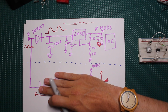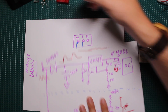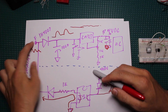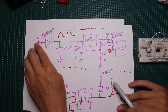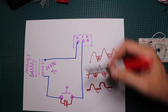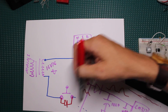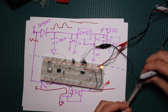The circuit has two parts: a power supply section on top and a negative-going detector circuit on the bottom. The terminal F here represents the same terminal from the original wiring — we don't want to change anything, same pinout. I added another diode, a 1N4007, because if you press the button you suddenly have a full AC waveform coming in and you need to rectify it. There's no harm in having two diodes in series — you'll still get the half-wave waveform when the button is open.